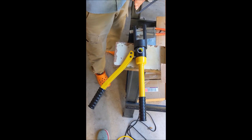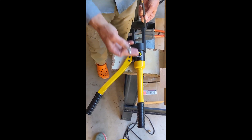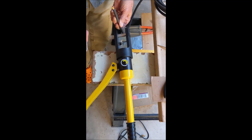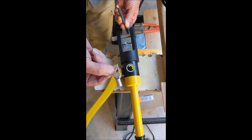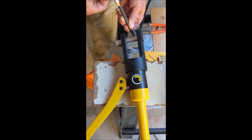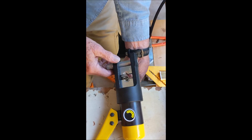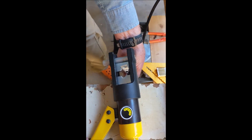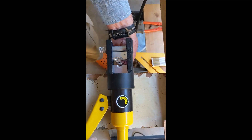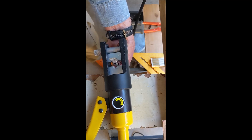We've been crimping cables, but I want to show you the procedure. This is a hydraulic crimper. This is a number four cable. This is a cable terminal or lug — it's for crimping. We slip that on after you strip back the wire, that goes in there, we clamp this down, and then that crimps out to done.